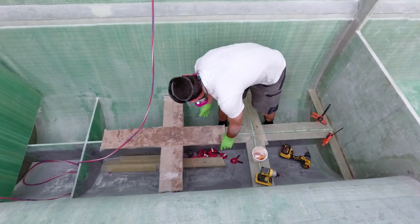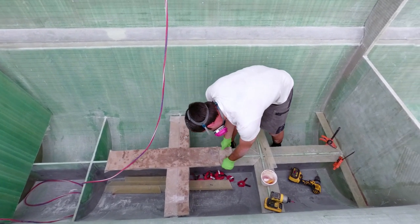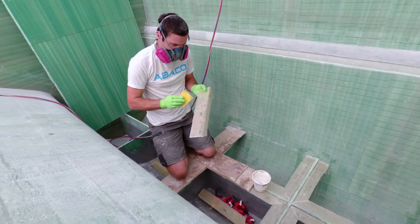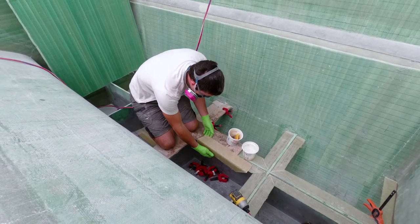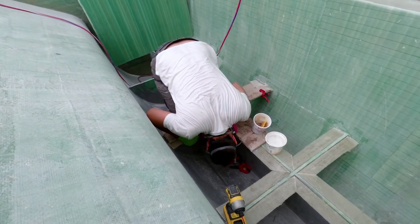Moving forward into the area which will be the hallway and the owner's hull, we could use our mold again to hold our pieces of fiberglass where they needed to be. For this project, we're using a thickened polyester resin to do the bond. Although we have been able to get more vinyl ester resin on order, this is an area where it was easy for us to make a temporary switch until we can restock.